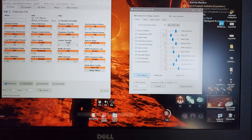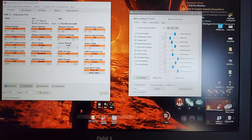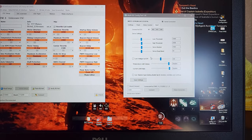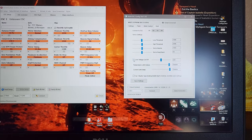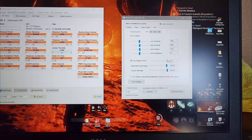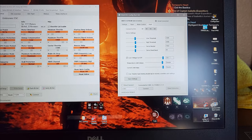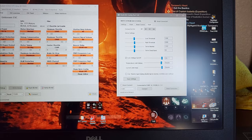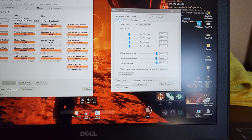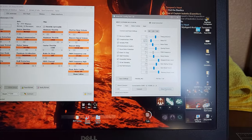Go to save settings — up here it says 'write successful'. Then go to input, turn on your LVC, and I crank it all the way up to 350, which I'm pretty sure means 3.5 volts per cell. That's preference, but I don't ever run my batteries that low anyway — it's just good to have. Once that's all set, close the connection.